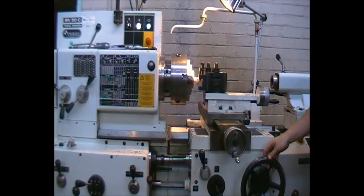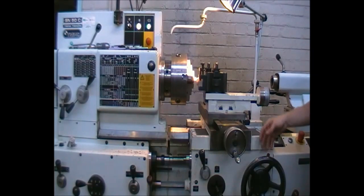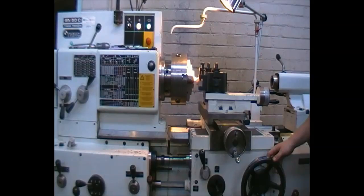The further you reach the inner core diameter of the part, the slower you must start feeding. A nice visual representation of this is to look at the shavings and the shaving manner. You are looking for a shaving that is about 3 cm long and chips off, or an ongoing shaving. Please listen to the machine carefully as this will give you the best indication of the machine's condition.